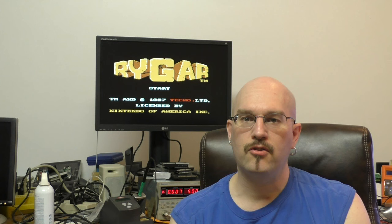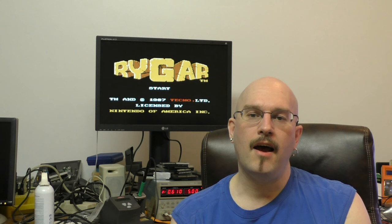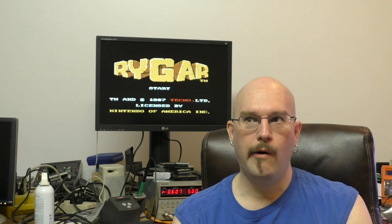I wanted to get the boards done quickly, and I checked out the quick turn prototype circuit board houses in the US, and house number 3, let's say, I'm not gonna name any names, I sent them the design. And then it was going to cost like $650 to get 6 boards made. And they kicked it back after I paid and everything, saying, we just can't do this. The clearances are just too small.